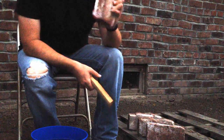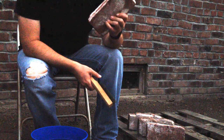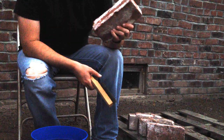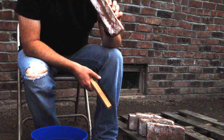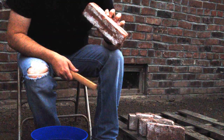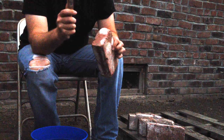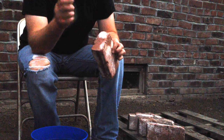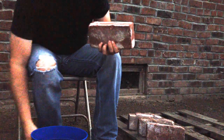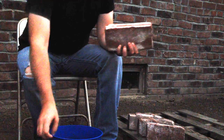I've got a maybe 80 or 90 year old — it's an estimate — clay brick that I obtained from a salvage yard in Los Angeles. And I'm going to show how to remove the old mortar that's still adhered to the brick. It's very simple: get a wire brush from your local hardware store, these are usually only a couple dollars. You need a plastic bucket and some water, just regular water from the hose.